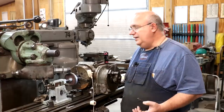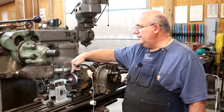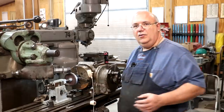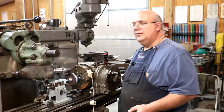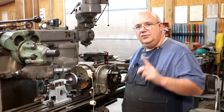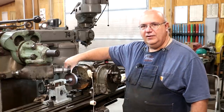Previously when we set up to do our previous piece, I've already got this thing centered up on the shaft where it needs to be. What we need to do is come in here and touch off on this gear — that will become our zero mark — and then we will need to feed the cutter down to actually make the cuts. Because we're cutting in cast iron, I don't want to go the full depth on the first pass, so we're going to do this in multiple passes.